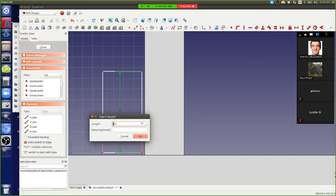Now, we couldn't do that before in the blocking because we needed 4 before, so we could not use a 2x4 nor other dimensional lumber lengthwise because there is nothing that's 4 inches. We have to cut off 4 inches, and we said we cut that out of 2x6s, actually, right? Yeah, which is decent enough. You've got half of the space covered, so you don't warp, you don't twist your joists